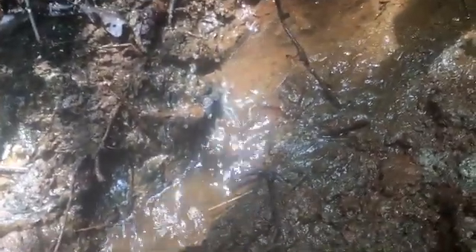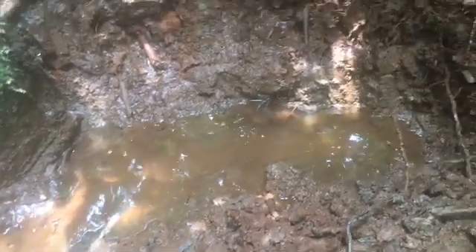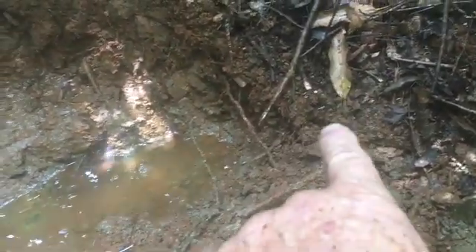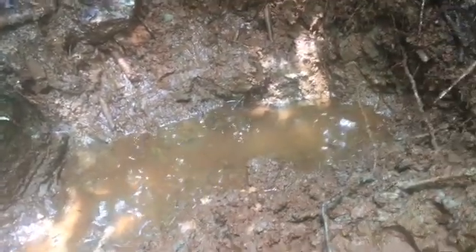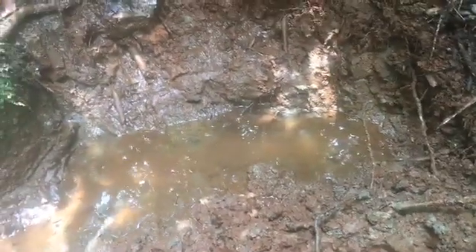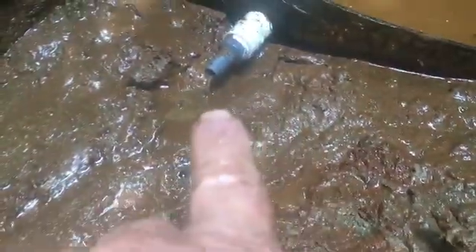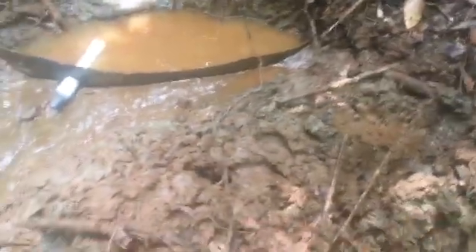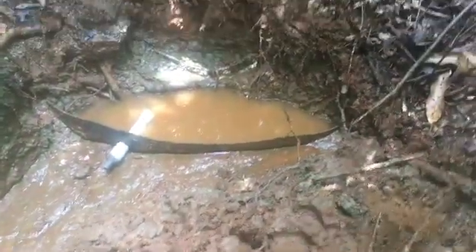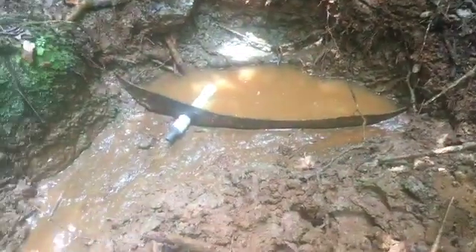While I was gone it puddled up this much water in the hole. We're gonna start driving the plastic in from here up into this mud wall on both sides. We'll take a digging bar first and make a trench for it to sit in, check the rocks, and then use a five-pound hammer to drive it in. It's still doing over a gallon a minute. The water's pretty muddy and hasn't settled down, but where it's flowing up in the sand layer it's still clear.